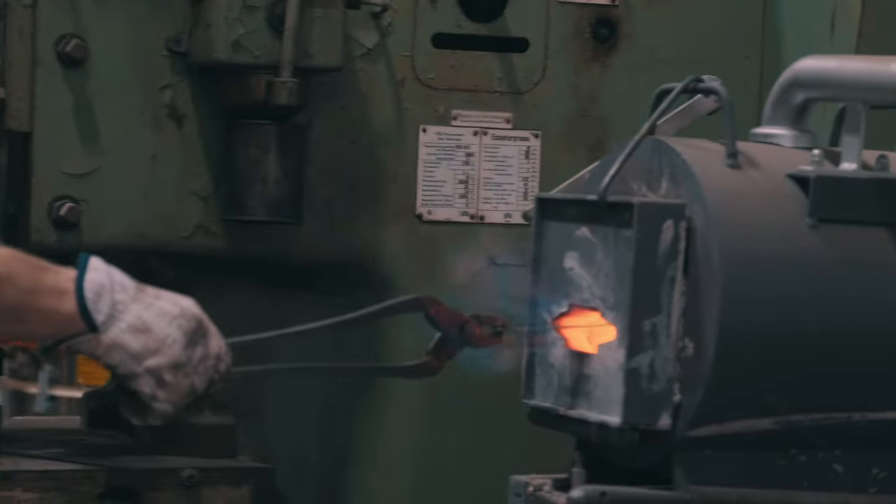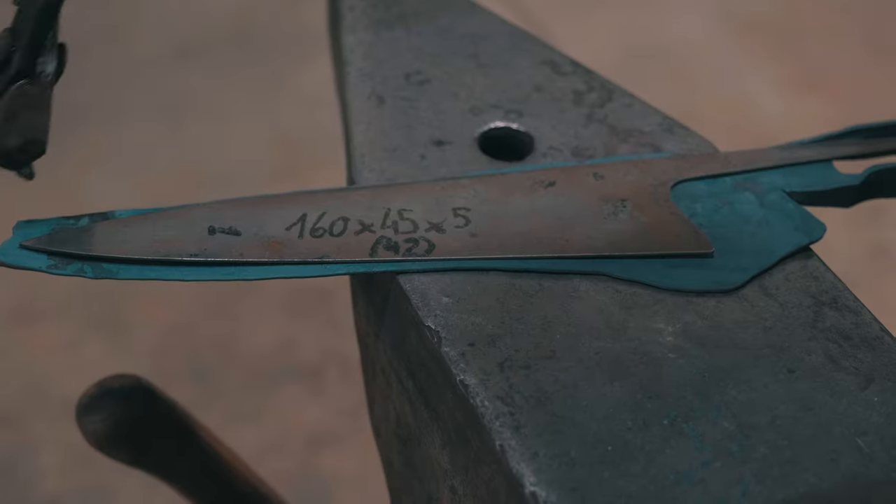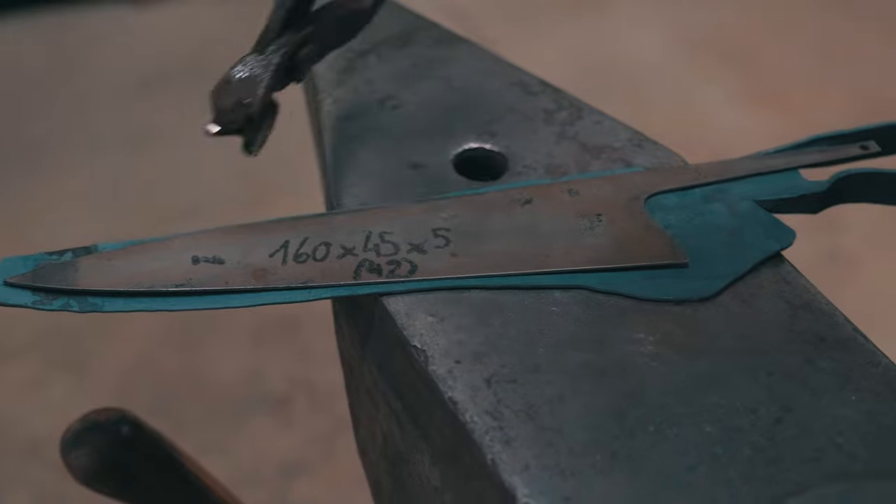After that, I'll forge the height of the blade also with the half-round dies and just dial the height in — hopefully ending up with a rectangular piece I can fit my template out of.